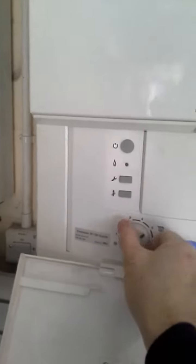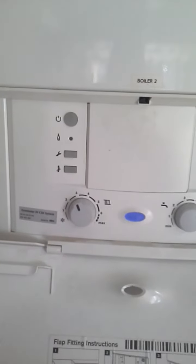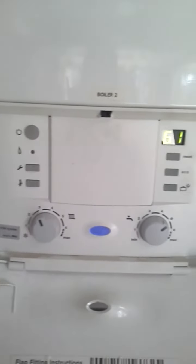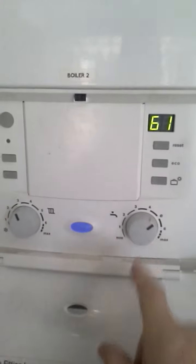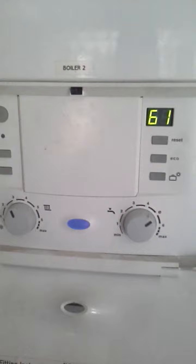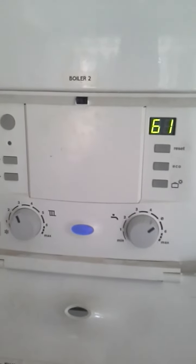What I'd like to do is, when it's on central heating function, be able to run it down as cool as possible to try and take advantage of the condensing mode of the boiler as much as possible. And then when it goes into hot water mode, send a signal back to the boiler for it to run at full temperature while it's doing that.